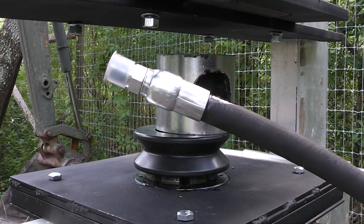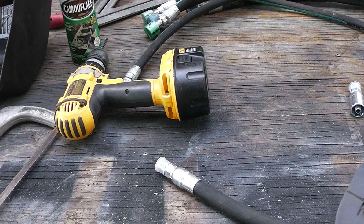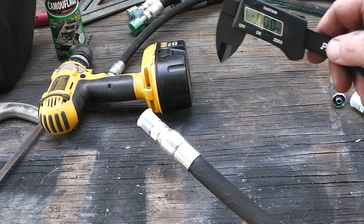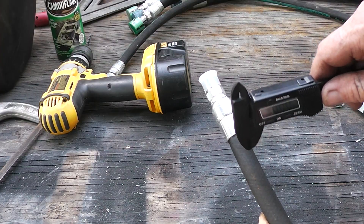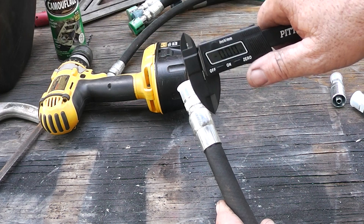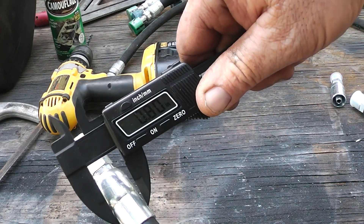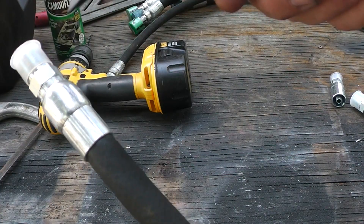That is a crimped hose. To do this properly you have to use a micrometer, and there's a chart on the internet for this particular type of fitting. This is a universal hose crimper — it doesn't have to be these fittings; you can do Eaton, Parker, or whatever, as long as you have the right specs. This particular is a 3/8 fitting on 3/8 two-wire hose rated at 4,000 PSI. For it to be properly crimped, the spec on the flat spots is supposed to be 0.800 inches. That's speccing out to exactly 0.80, so this tells me it is properly crimped. The homemade deal was a success.